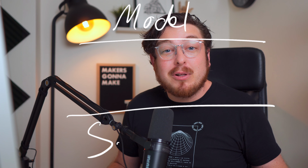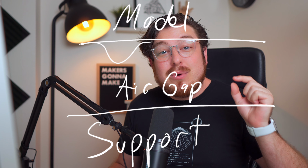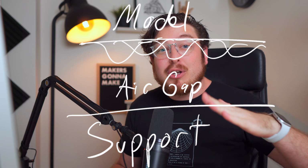If there's a large air gap in between the top of the support material and the underside of the model, then it does make it easier to remove the support material, but it gives you a certain area where your printed part can droop, giving you a terrible print quality. If you minimize that air gap to try and give you a better surface quality, then it means your support material is going to be adhered to the model so well that it's going to take so much effort to remove it, and it's still going to leave behind some crumbs of plastic.